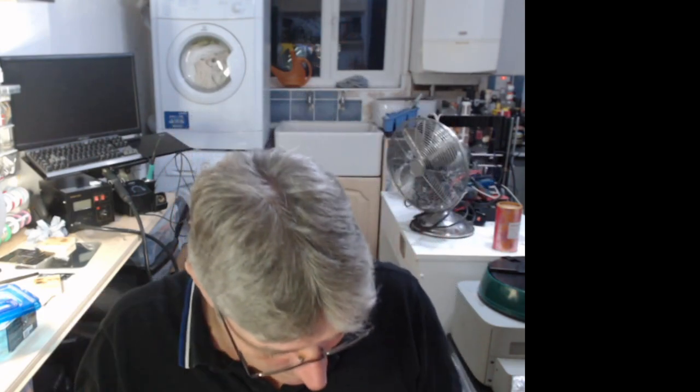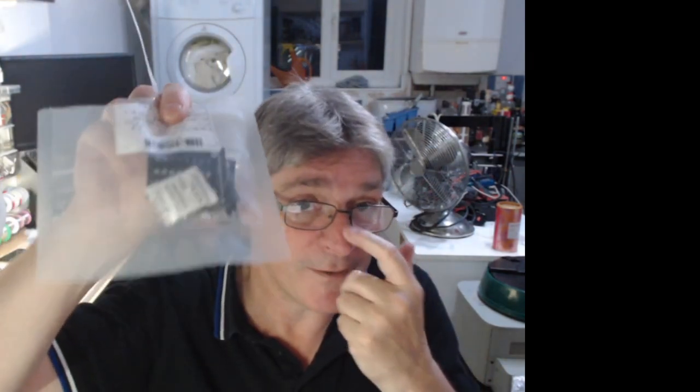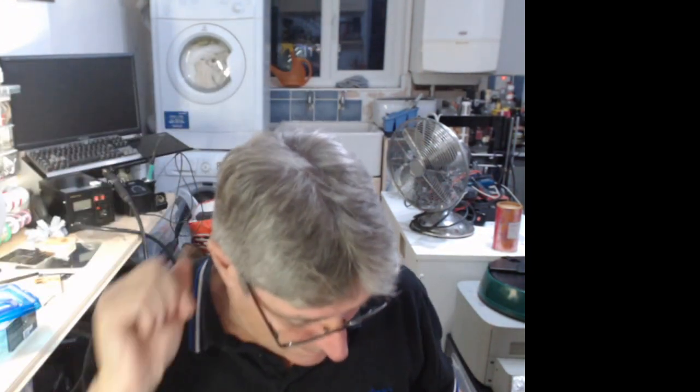And that's basically 8 MOSFETs. So you can sink, you know, several amps for each one of those. And I can use that for a couple of different things, including driving those small unipolar steppers or switching on loads, that kind of thing. So that's to do. And again, I'm waiting for these MOSFETs to arrive.